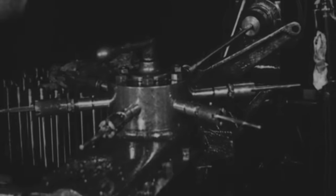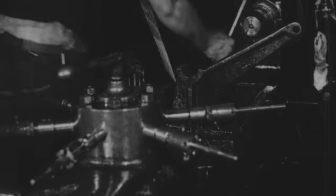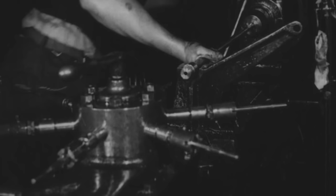I think he's drilling for a chamber. It does look like a chamber reamer, doesn't it? Yeah. Facing the camera slightly to the left is a basic drill, and then there's a series of roughing and finishing reamers going on there. So I think that's way out of order. I think that's at the end of the barrel making process.